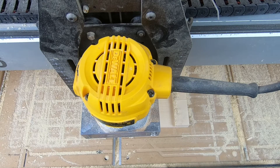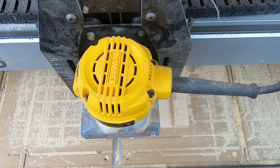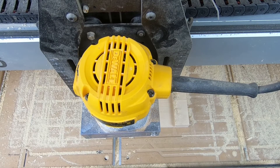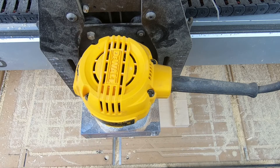I forgot to mention that I am using 3-quarter inch pine — real cheap, soft wood — and I'm using a quarter inch end mill to do the cutting. So that finishes the first cut. The second cut that I like to do is I make a step up for the bees so they don't have this big ledge they have to get through. You can just come in low and step right in and it gives them plenty of room. We don't have to readjust our XYZ setting because we're not moving the piece, so we're ready to rock and roll.